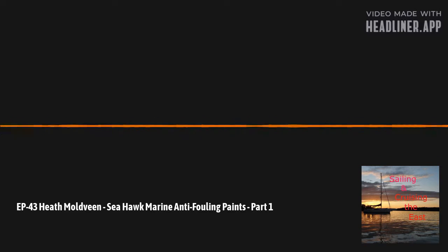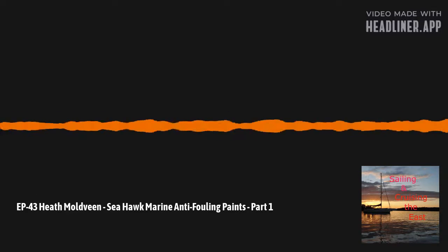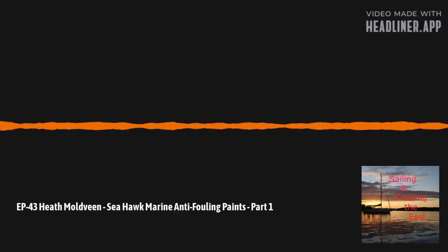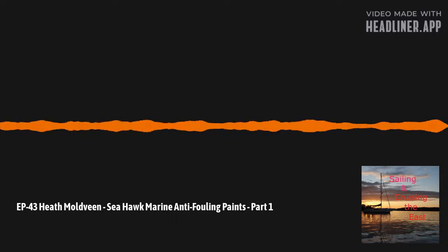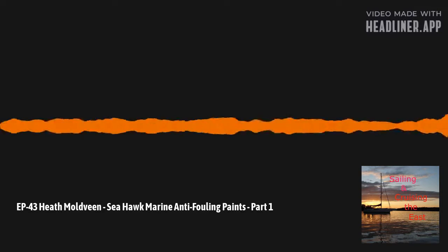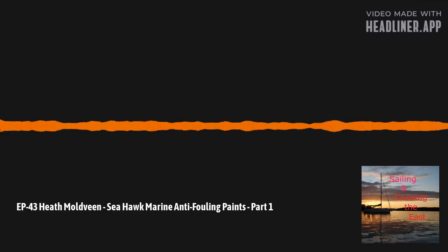And resins are really the key. It's not necessarily how much copper you have, which traditionally that's what people would look at. And in a hard modified epoxy, that is key because it's not controlled. So the cool part about ablatives and these resin hybrid technologies is that it's a bit more of a controlled release, which gives you consistent performance across the lifespan of the paint. Think of it more of a plateauing curve versus a downward curve.